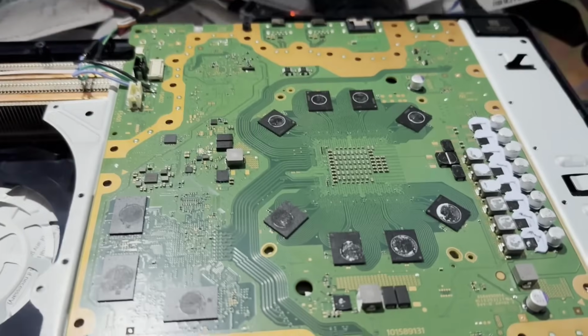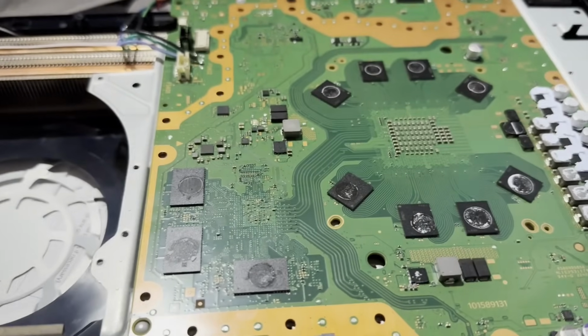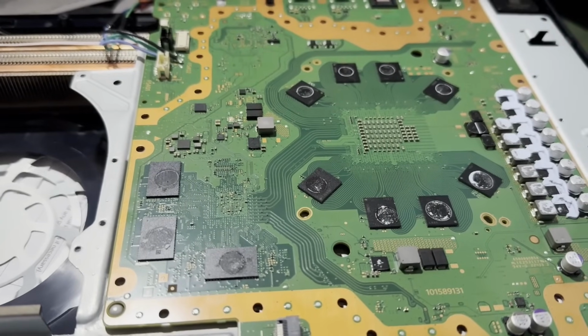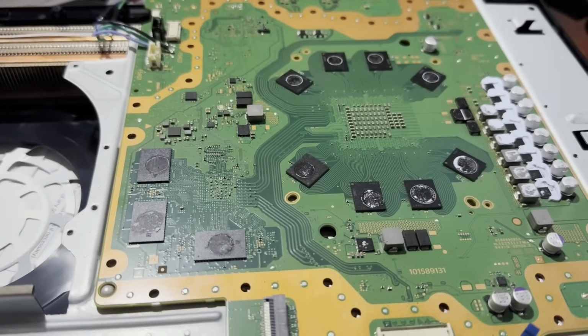All right, let me get an SSD controller, which is right there on the other side of the board. Get one of those reballed and ready. If I don't have one already, we'll get it swapped out. See if that changes our error. Yeah, it probably will.